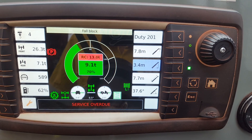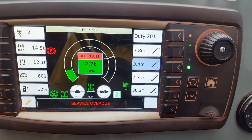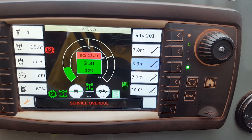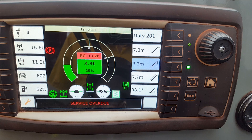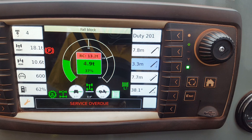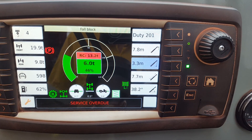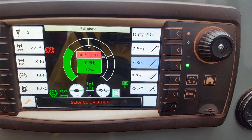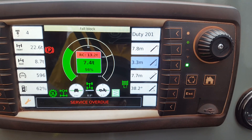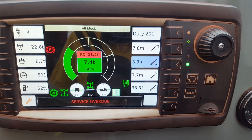So we need to counter that — come back down on the hook and it's gone to 3.3. So what you can do is jib up from here. Now I'm jibbing up and that keeps it on 3.3. See it stays on 3.3 — I'm jibbing up now and it stays on 3.3. So you know that the load is going to be center, it's going to be straight, and when you lift it up there's going to be no swing and you're going to look like a pro.